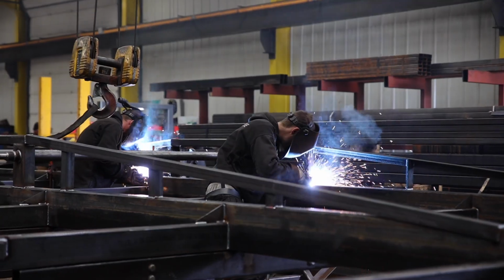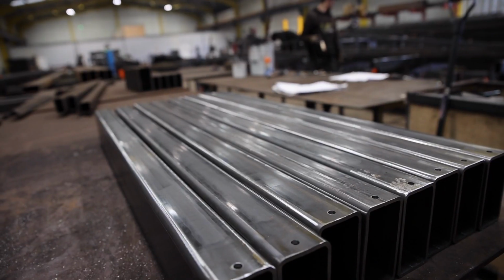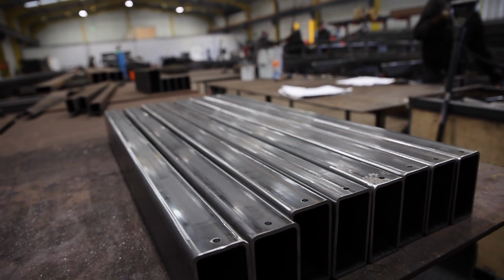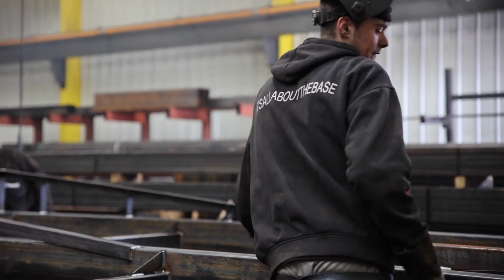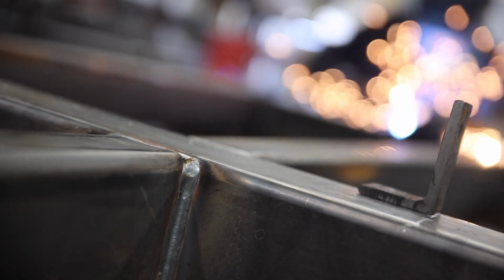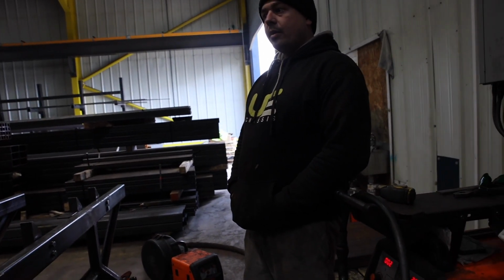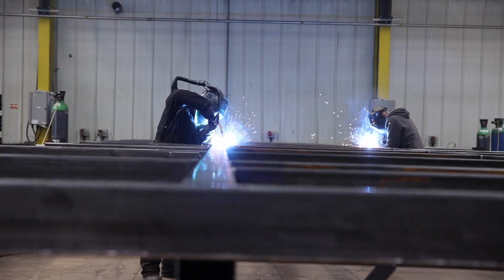Yeah, and you can only really do that if you've got all the lifting gear. Almost all of our rivals build the right way up, and if you look underneath, they won't do the underside welding. So you're almost always welding in the best position. You have three or four people welding at the same chassis, all at the same time? Yeah, four people are running in the jig currently.